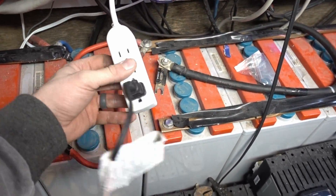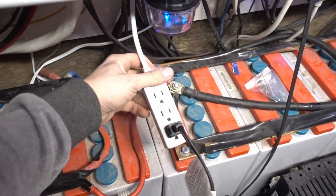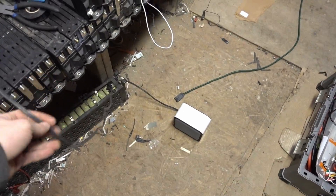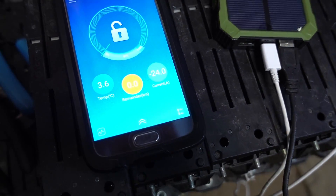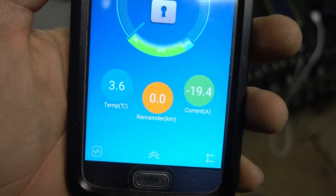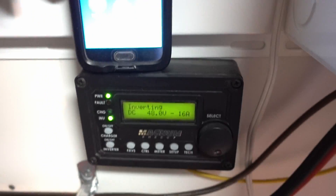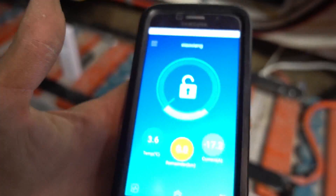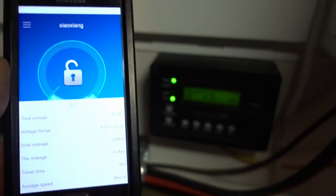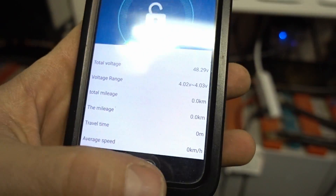I just quickly hooked up a receptacle — I disconnected that so I could use it quickly. This is my breaker here, it's way too big for this receptacle, so be very careful — this is just for testing purposes. I hooked it to my 750 watt heater and turned the inverter on. We're pulling 19 amps. Side by side the readings show 17.4 and 16. Voltage-wise this one's saying 48.3 and this one's saying 48 — the loss is in the lines, which makes sense.